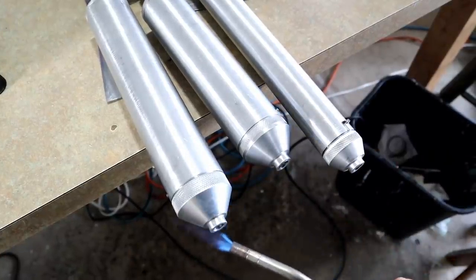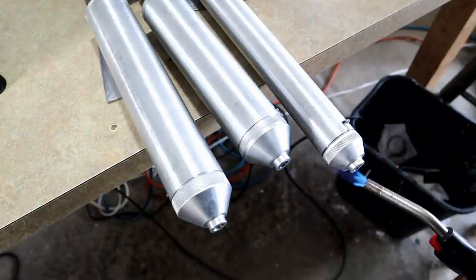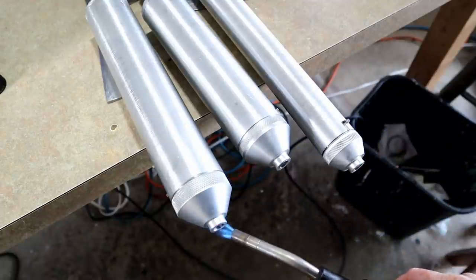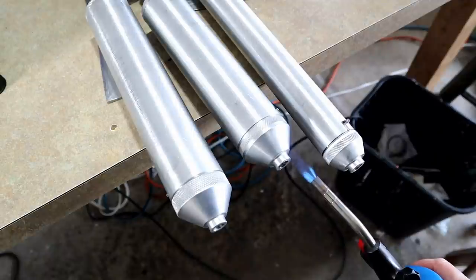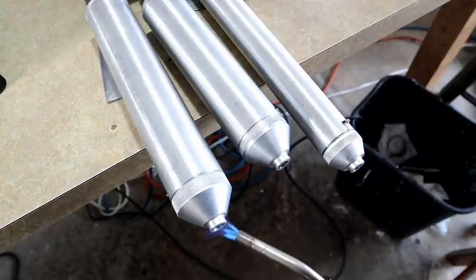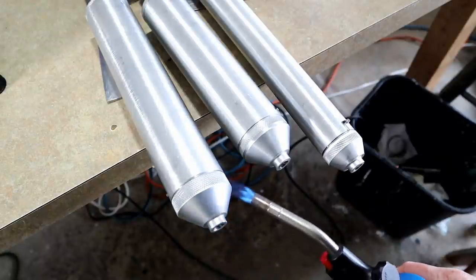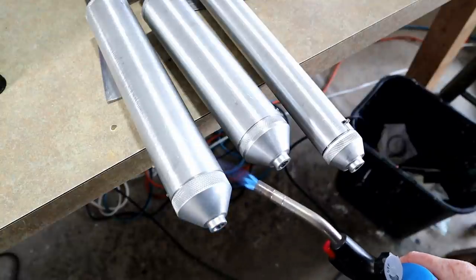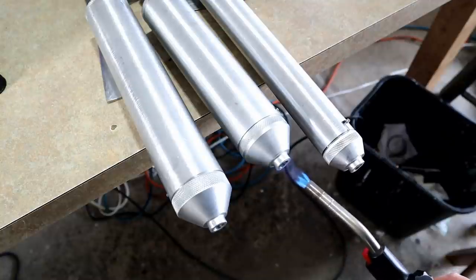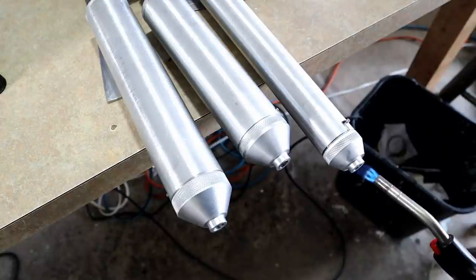It is cold enough that we need to do some preheating. When a lot of people start this hobby, depending on where you live and how cold it is in your shop, temperature has a lot to do with your success. You might start getting dents in your baits, and that's when your mold is just freezing cold and the plastic's cooling too rapidly. When plastic cools down fast, it shrinks faster and you're gonna be more prone to denting. So preheating your molds is a big thing there.